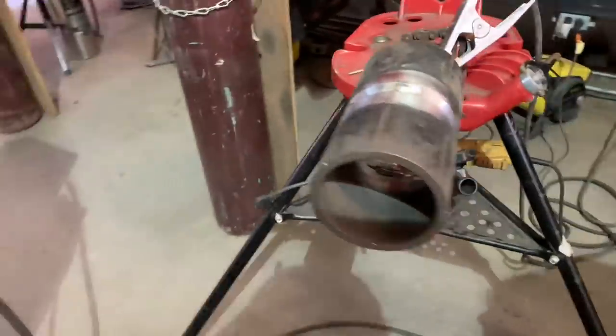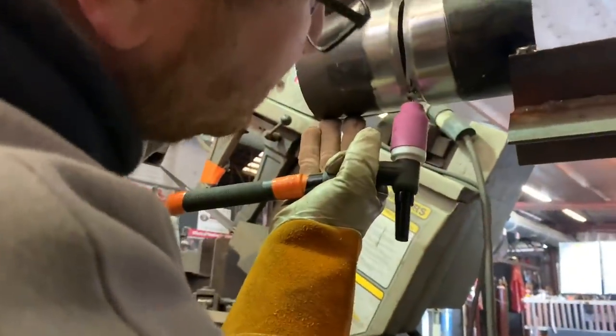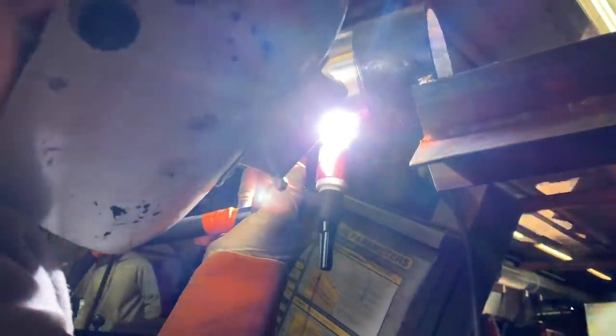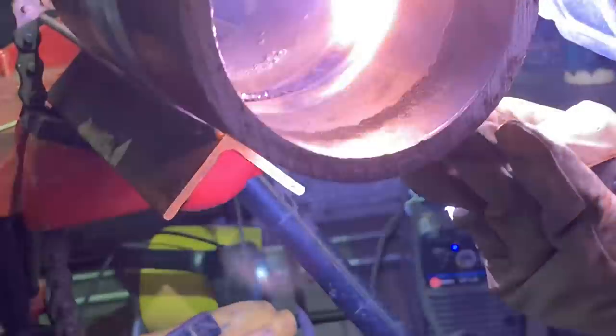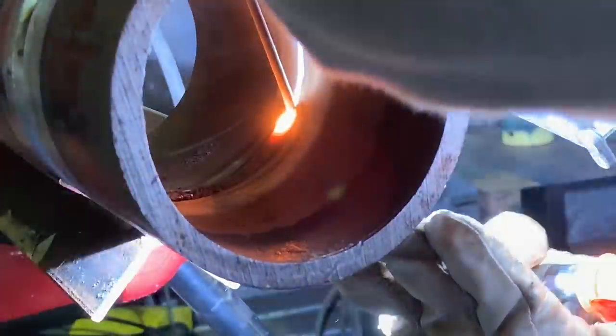A lot of people don't have a whole lot of experience welding this flux coated wire, but like I said, it'll get you by in a pinch where you can't get access to purge or can't purge for whatever reason. A lot of people just won't do it because it's different or they have to go get a procedure accepted, but man it is worth it — just to have a backup in case you can't get a good purge, and it'll leave a pretty bead in there. It takes a little bit of practice but once you get it, it's easy.